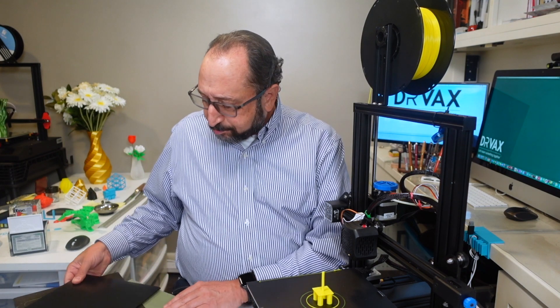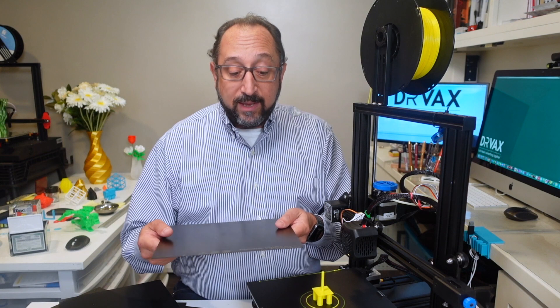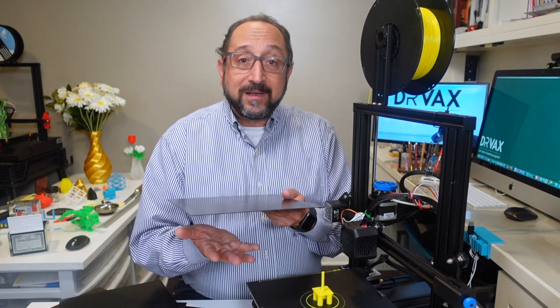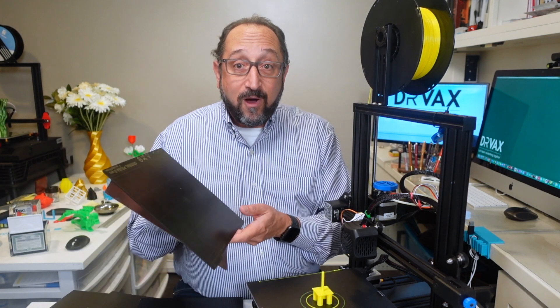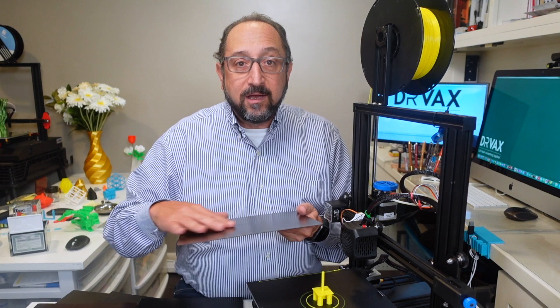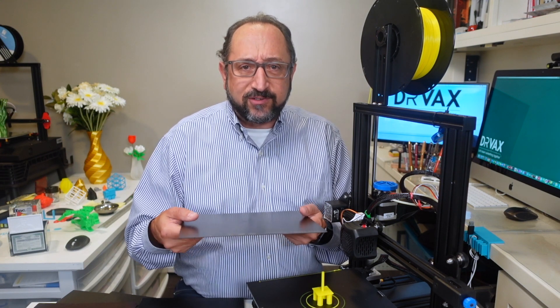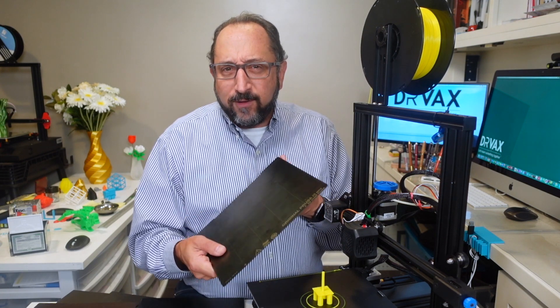Some other print surfaces to consider come from other manufacturers. I have a Prusa i3 MK3, and it came with a very interesting print surface — a flexible piece of spring steel locked onto the print bed with a magnet, similar to the magnets on the Ender 5 that hold the print surface in place. The advantage of this print surface is very good adhesion; in general, I don't need to add anything to it. Adhesion is activated by heating the surface. I found 60 to 70 degrees Celsius excellent. When it cools to room temperature, you just flex it and the print comes off.